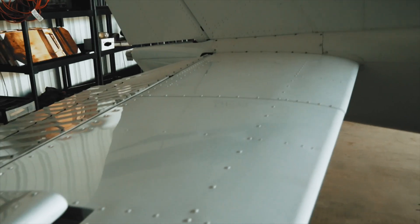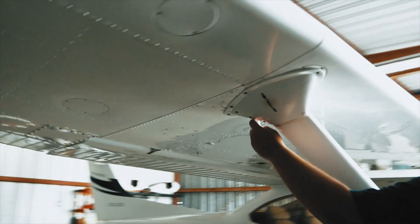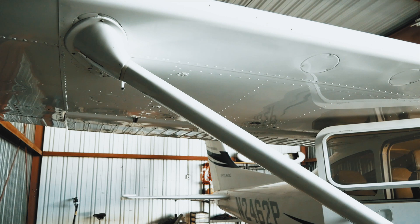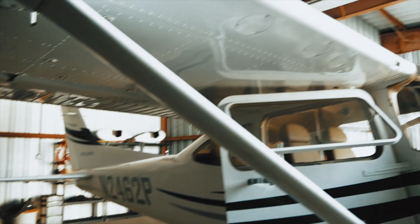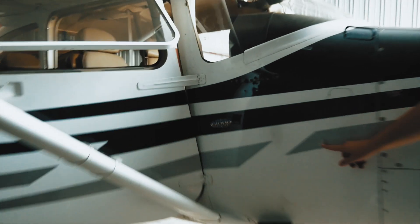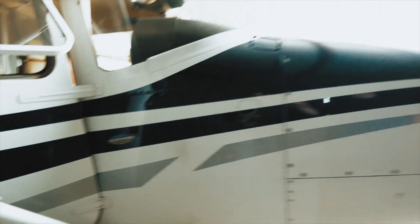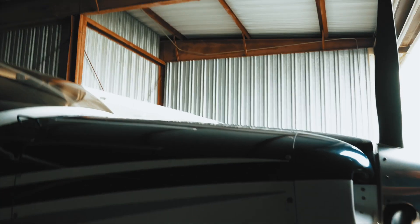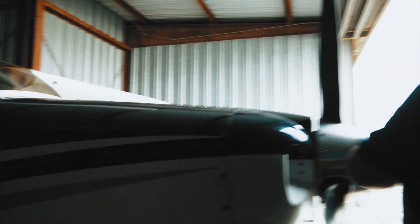The rear horizontal stabilizer really does sit a lot higher up than the Skyhawk. That's going to be where the fuel would drip out. This has thirteen total fuel sumps — five under each wing and three underneath the body. You also have an alternate static source — a secondary — so you've got two extra things to check on the external. The stall vane is different on this too — the pre-flight test checks that it triggers the warning.